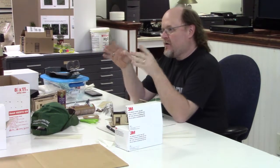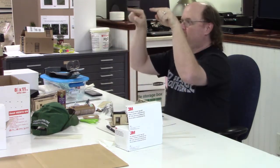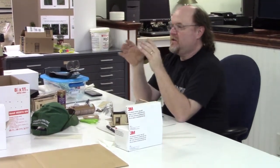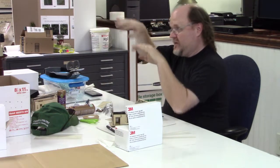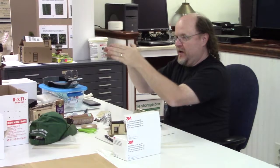The shingle itself has three tabs on it. When we always roofed them, you come across where that tab is. There's a little line that runs up, rounds over, and comes back down again. That separates them into three, right? You complete that line all the way across the shingle. So what you end up with is three individual shingles instead of one tab of three. You turn it, you start on one end, and you hammer it down on one side of the roof, you fold it over the peak, and you put it down on the other side.